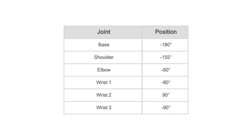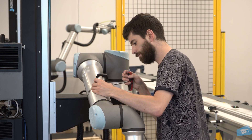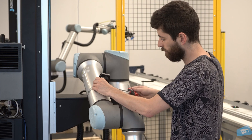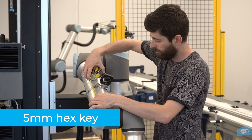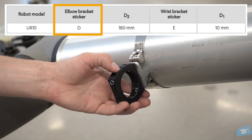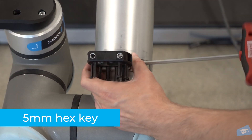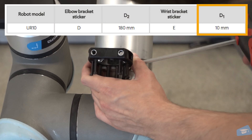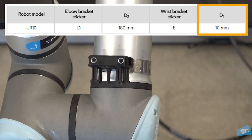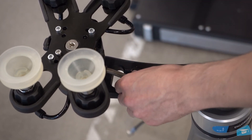To finish the installation, change the robot position — refer to the table below for the exact position of every joint. Once the robot is set in the desired position, attach the IGUS Triflex R-Series cable routing system to the robot as demonstrated. Using a 5 mm hex key, secure the elbow collar assembly (the larger collar) to the arm, accounting for the orientation and distance from the elbow D2. Clip the mounting bracket of the elbow collar assembly on the cable carrier. Using a 5 mm hex key, secure the wrist collar assembly (the smaller collar) to the arm, accounting for orientation and distance from the wrist D1. If you use the extra reach bracket, make sure to first run the coupling cable through the second hole of the bracket.